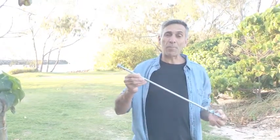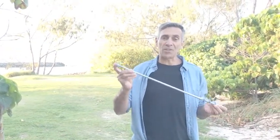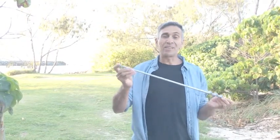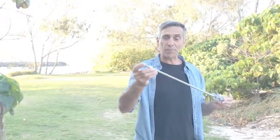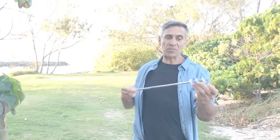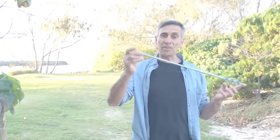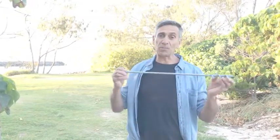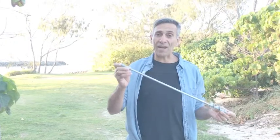This is our Sand Grabber Pro. It's 600mm long, so it's twice as long as the Ground Grabber Pro. It's also made out of heat-treated galvanised steel. It has a 19mm hex head, similar to the Ground Grabber Pro, but its flights or spirals are twice as wide. Because it goes down 600mm deep and has twice the wide spirals, it's good for soft sand, hard-packed sand, and loose ground.